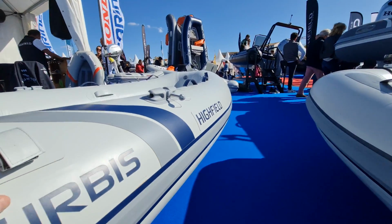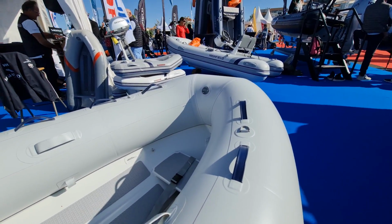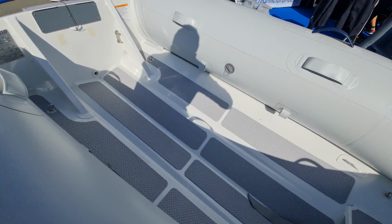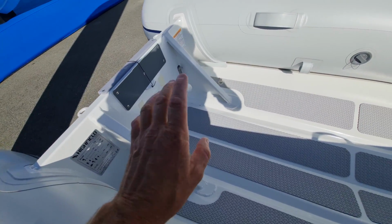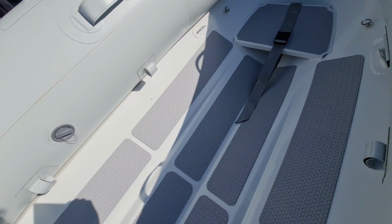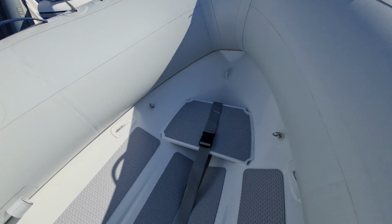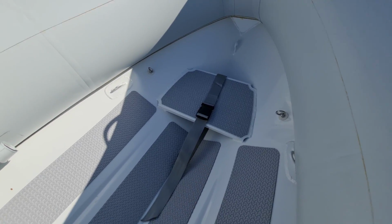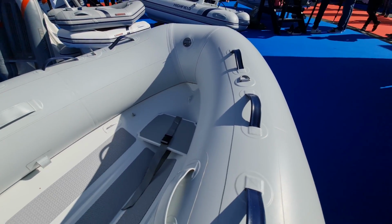Ultralite, different. Tubes themselves are very, very similar. Slightly narrower in the bow is the Ultralite, but the biggest difference you'll find in here is it's a single skin. So it's a single skin, same hull thickness, same transom knees, same strength inherent in the boat, but there's no false floor. So if you ship any water on board, it will sit in that V. We give you a fuel tank pad, but again, your fuel line will be running along the deck. Everything about this boat has been built to make it as light as possible.